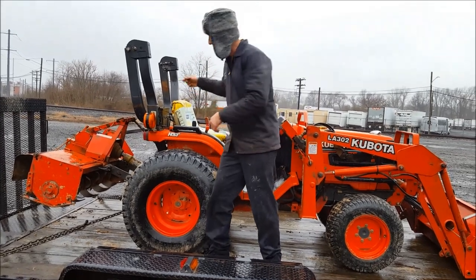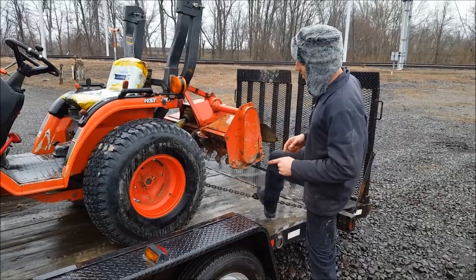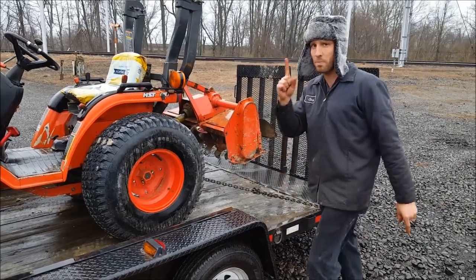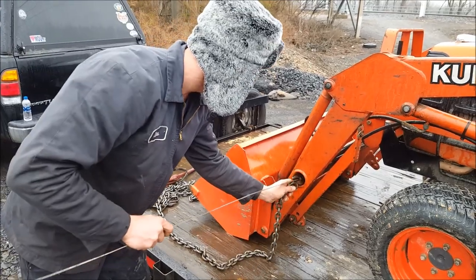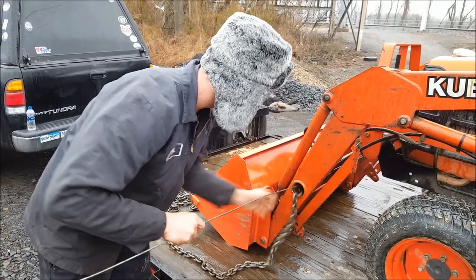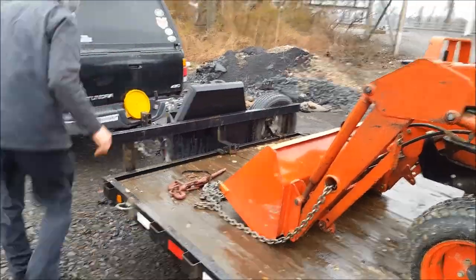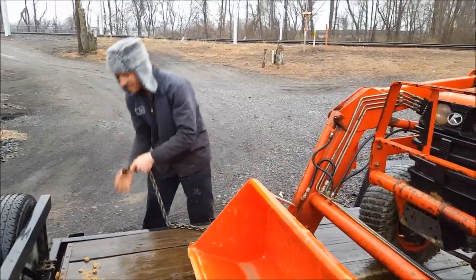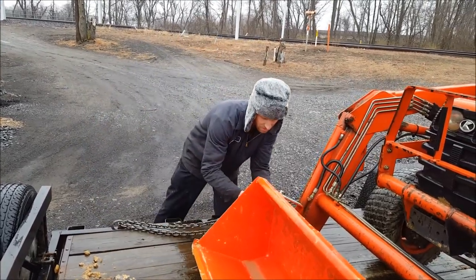Take the key, put it in the ammo can. Now since we used that method, our rear chain's already taut, so we should only need one binder. Take this stick here that's stowed away with a magnet. Take the hook in and push your chain all the way through. You can leave the stick in there. Pull some slack through and hook it back on here on your chain.